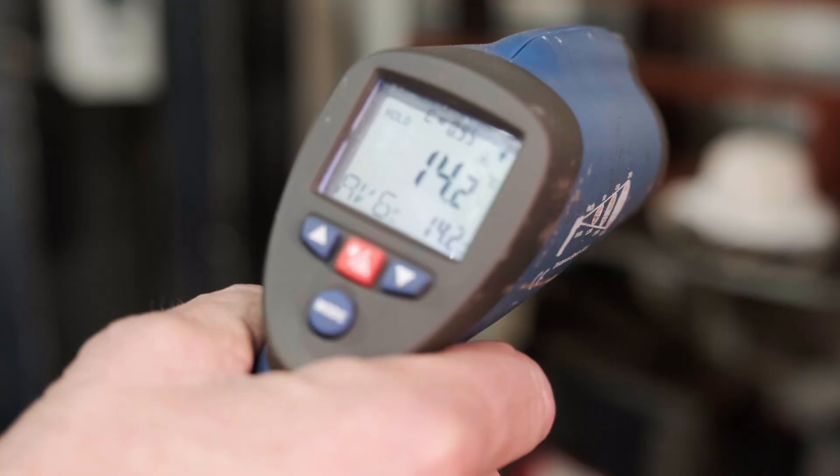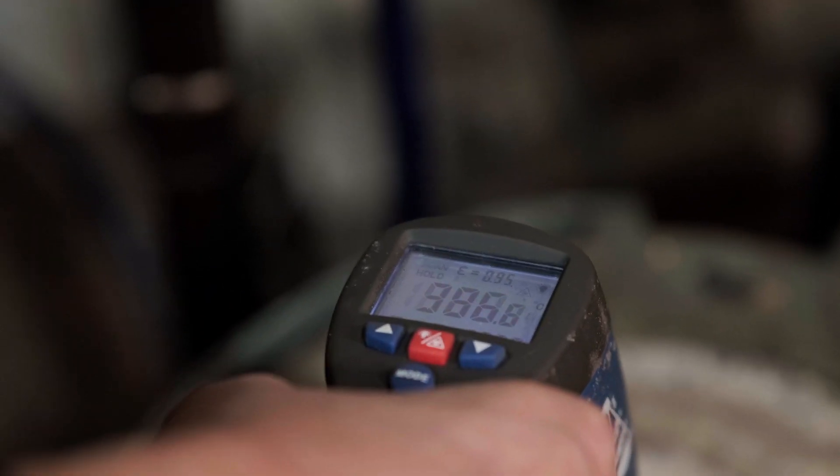You've got to quench it enough. The critical time when you're quenching — take carbon steel now. Stainless steel is different, but it's the same principle; the numbers are different. Take a piece of carbon steel: you're probably going to be around about 850 degrees. It could be down at 780, it could be up at 900, but let's call it 850 for average.